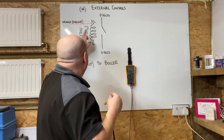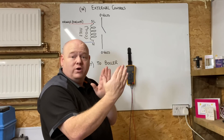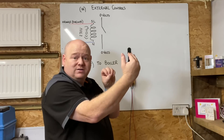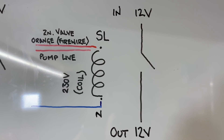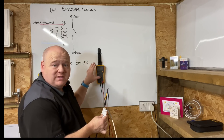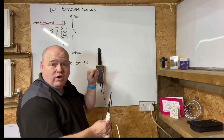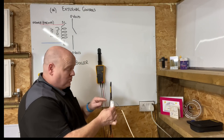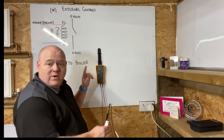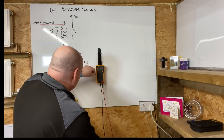On this particular one, we get the switch live coming down the orange wire onto the relay. We want the boiler to work but we don't want that switch live wire to touch the wire going back to the boiler - it keeps them separate. I've put the multimeter onto the beep function - I'll turn the power on. The orange wire is now coming back to this relay, and we can see it's bleeping, showing the circuit is closed.